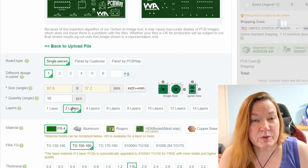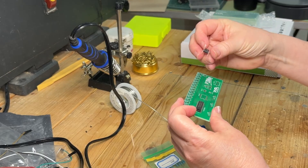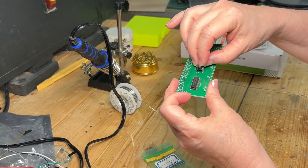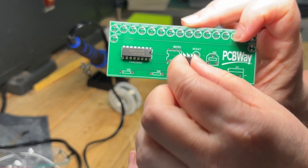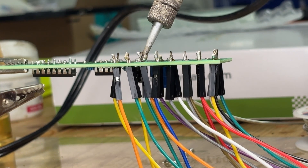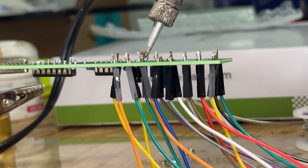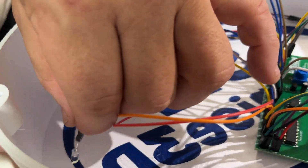There are links in the description for the parts I used, and they're all pretty inexpensive. For a power cord, we just cut the end off an old USB cable and used the red positive wire and the black negative. The data wire can be totally ignored. The board is keyed to show which way to install the components, so it's nearly impossible to screw up. It was also designed to have the LEDs soldered to it directly, but I wanted to spread the lights out around the shape of my logo. This meant using DuPont wires, which are designed to work with breadboards and work great for this project. I soldered the male end to the board and then attached the female end to the LEDs and held them in place with a dab of hot glue.